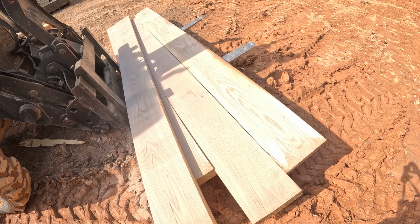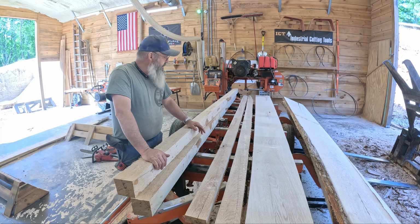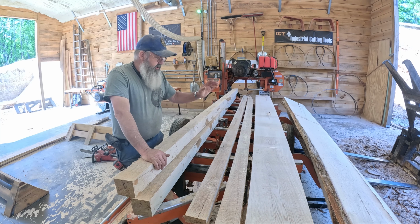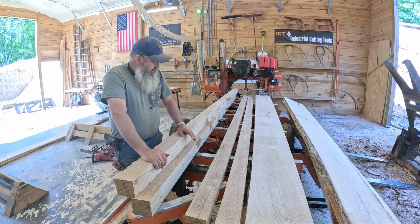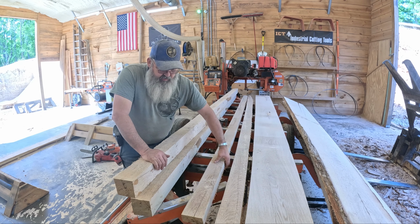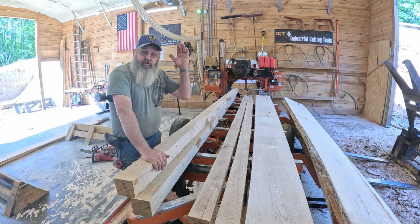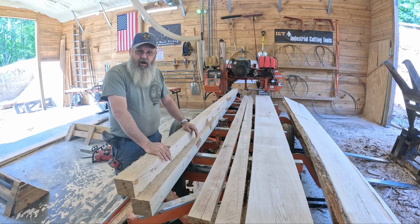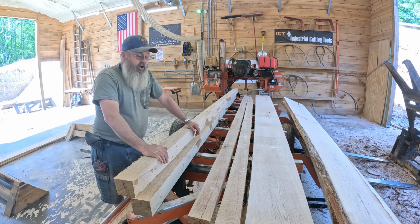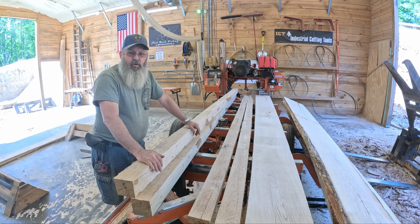All these 2-inch slabs, I have customers all the time wanting 2-inch wide oak, live edge type stuff. So we'll sticker it, band it, air dry it, and eventually it'll go through the kiln. One of my tree buddies called me the other day. He needed some true 2x4s for stake sides on his dump truck. He broke a couple of them. And Matthew and I always need 4x4s for dunnage. And this heart has got so many defects in it, that's good use for it, just dunnage.